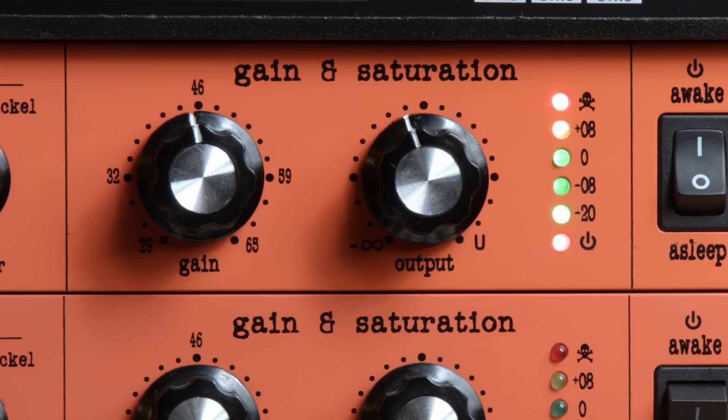Okay. Now in this example we're going to be pushing that preamp pretty hard. We can see from the meter that it's pretty maxed, but I'm going to be using my ears — I really don't follow the meters. Basically what I do is use that attenuator on the right to make sure the converters don't clip, then I ride the gain up as far as possible until I actually get some crackling within the preamp, some really unpleasant distortion. From there I dial it back about 10%, and that's really my hot guitar tone, my really pushed preamp guitar setting. Let's check it out.